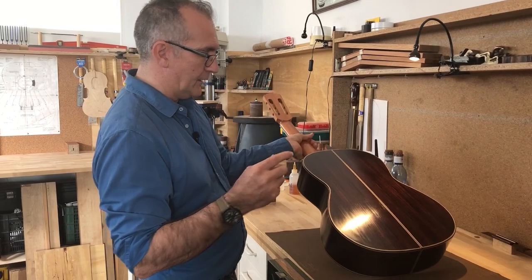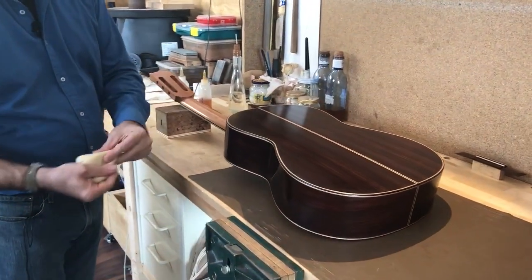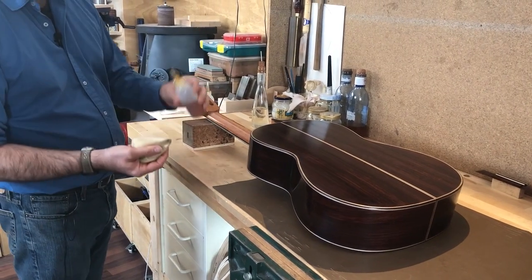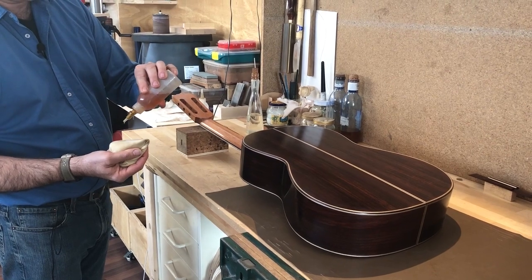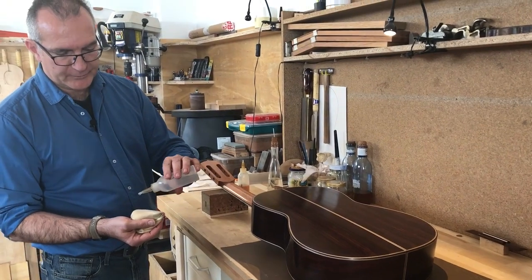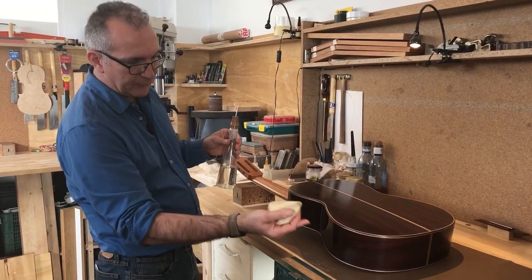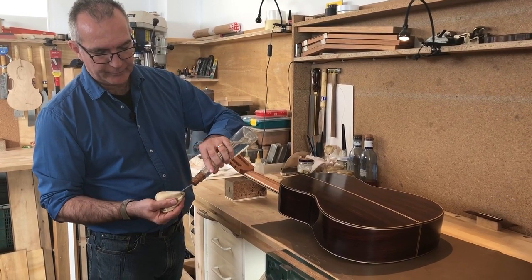So now I can put the guitar down like this. And again, I want to reshape, make sure that I always have the right shape here. And the same, we load the rubber with shellac, a little bit of alcohol, not as much as shellac, like that. And now the oil, I'm going to put it in the rubber, not in the wood, because it's not so easy to put it in there. So all I'm going to do is to put 3 drops in here as well.